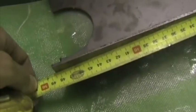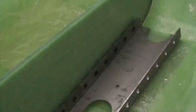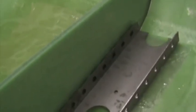This being a nose wheel version, the steel backing for the undercarriage I've shortened to 485mm either side of center line. The center line of the carry through spar is scribed on the part. There's the line. I've put the center line of the steel backing in line with that mark. Leave a gap of about 3mm between the steel backing and the rear face of the carry through spar to allow for the glass that's ultimately going to be in that position.